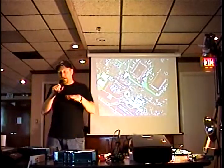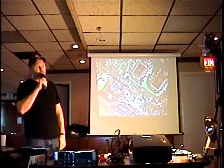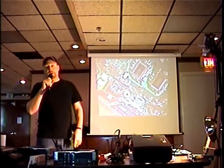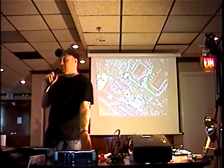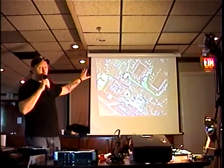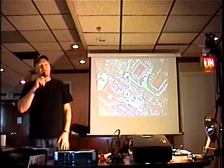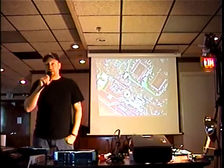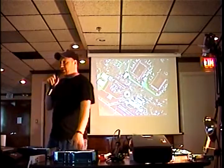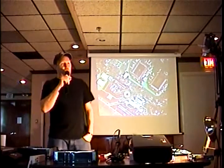Once you have everything back together, go ahead and power up the Xbox. Cross your fingers and watch the green light around the power switch. If it comes on green and it puts up the little flubber screen for Microsoft and it makes sound, you're still good. If it doesn't come on and it flashes red and green, start looking for a mod chip, because you just messed something up.